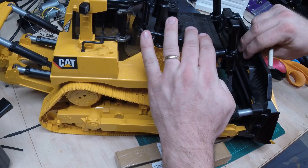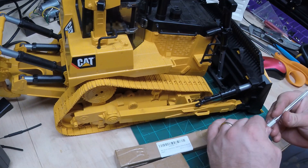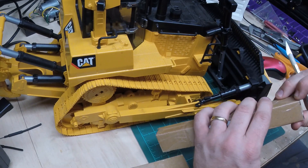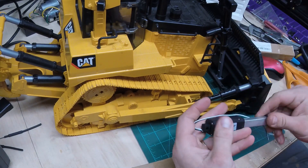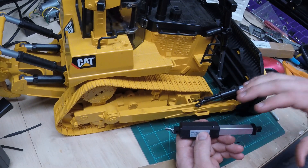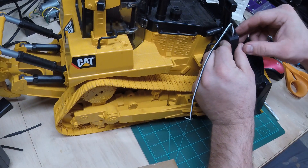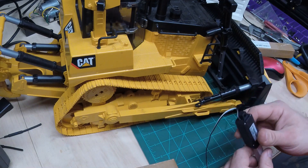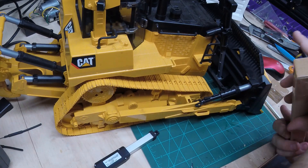These will take the place of the plastic lift cylinders - we'll hack those off and put the miniature linear actuators in place. I've used these on a couple projects. I got a low boy I made that used an inch and a half linear actuator for raising and lowering the neck. These work well, they fit in there pretty good. Gives you the nice range that you need, and you can control them individually to give yourself lift and tilt. So we'll have fun sticking them in there - might as well make this sort of an unboxing video as well.